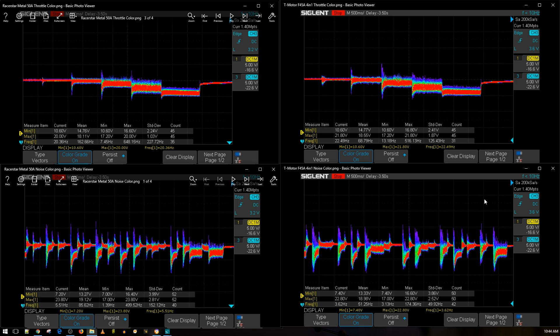You have to take a lot of things into consideration — this ESC is doing a lot: telemetry, F3 microcontroller, a bunch of features. I'm surprised it's doing this well with everything on there. What I've noticed is that on F3 ESCs you can get away with less filtration because the higher processing power can catch the phases almost perfectly every time, thus reducing back EMF — the voltage spikes or back inrush of current. That's why we can get away with fewer capacitors on F3s, but in hard crashes those spikes can get massive and burn components, so be careful.